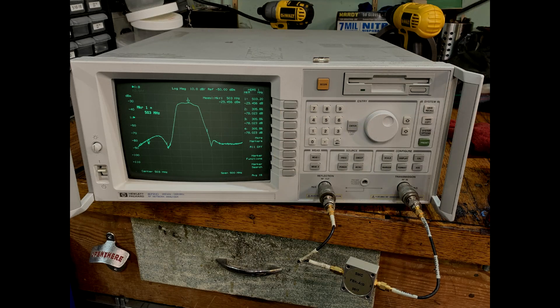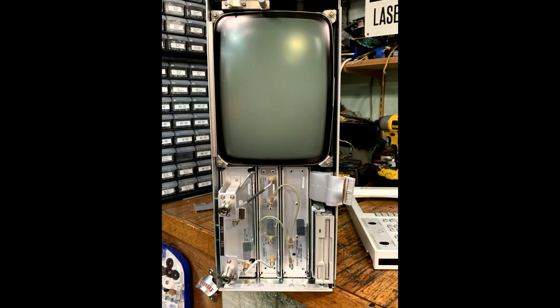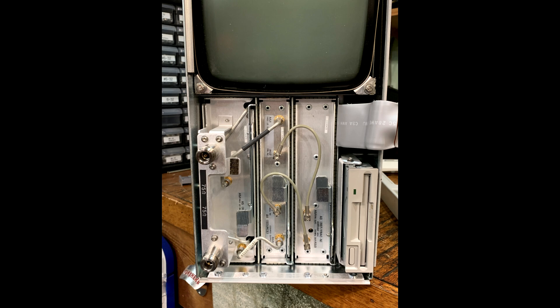Now that I have it working, the first thing I need to do is change those 75-ohm connectors and put some 50-ohm ones on there. The system ROM installed is version C402, January of 1997. I have the step attenuator and the 75-ohm option installed - which I wish I didn't, but I do. To do this, you take the front panel off by removing the ears in the front, then the front panel unbolts and is held on with just one ribbon cable. You disconnect that ribbon cable and look inside where everything is modular and slots. The module we're interested in is on the left - the one with the two connectors that has the couplers inside.